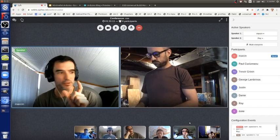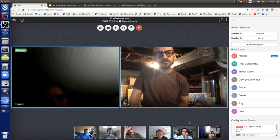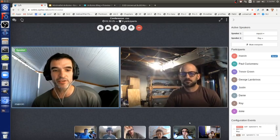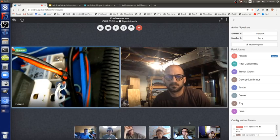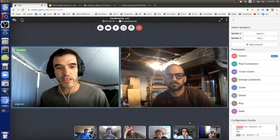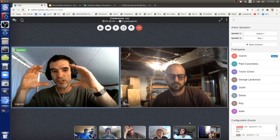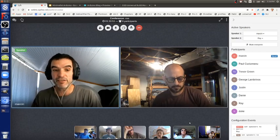You can use a tiny power supply, like this little power supply here. Just one of those tiny power supplies gets you a fast, high-performance heated bed, because you're running the 120 AC through the solid-state relay that's in the back there. You see that solid-state relay? That's what's handling the power. So you don't need a big power supply. You can just use wall power and just turn it on and off. So I would say it's a smart design, because otherwise you'd need a regular big power supply. You can get away with a tiny one and still have high performance.